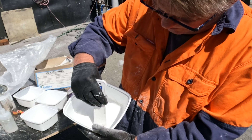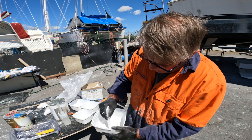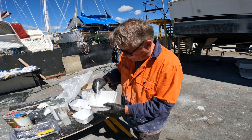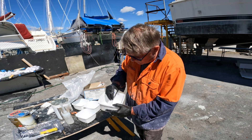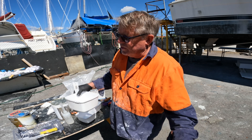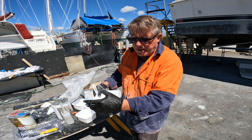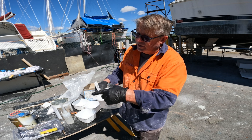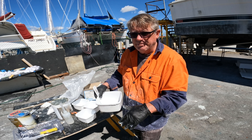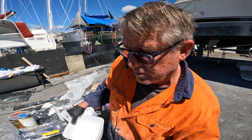That's all I really need — I'm happy with that consistency. It'll be nice and easy to sand. All I've got to do is go around with my little scraper and fill in those tiny holes and imperfections, then sand it back. Depending on how high the fill is, I might start with 80 grit, go to 120, then 180 and upwards. In this case I'm flow coating over the top so I'll probably leave it at 80 so the flow coat has something to key into.